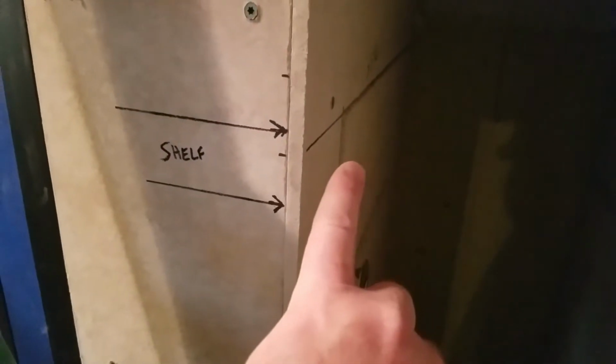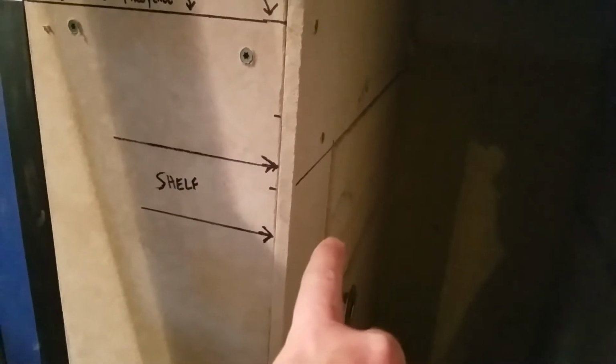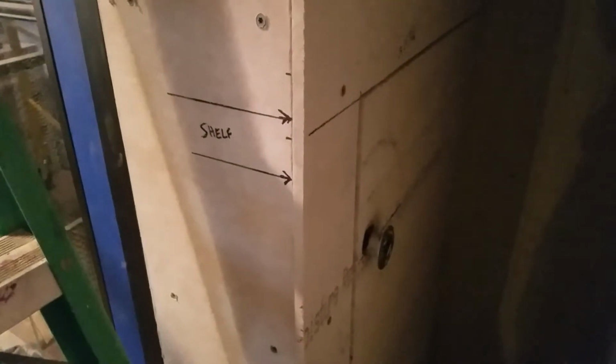And then at that point where the corners stop, we will go ahead and mortar the squares or the flats onto the removable door, and those will actually be drilled through and screwed onto the studding that we put behind it. So that way if they ever needed to get into that shutoff or that valve, they can always remove the veneer without having to destroy the stone, take that off, and then do whatever service work they need to on that side, and then be able to pop it right back in, and it'll be like they were never in there.